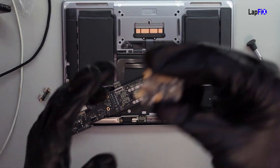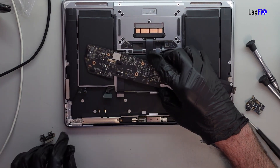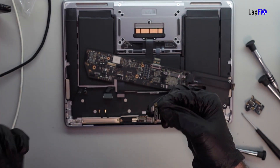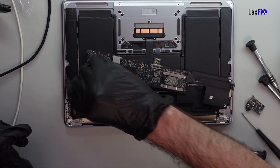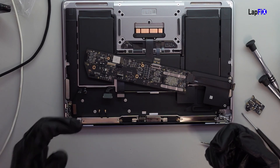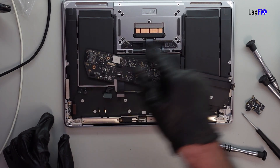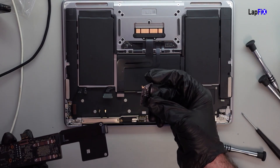But here we do see obvious damage. I did notice that one of the screws close to the USB-C port had a little bit of corrosion — a little liquid stain on it. But looking here, the USB-C port actually looks pretty good. These are modular, and it's very easy for liquid to seep in through a gap and touch something. When liquid touches the data lines and power lines inside, they could make contact with each other, and then you've got a big problem — you could short-circuit everything or cause issues with those ICs.